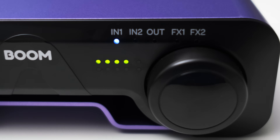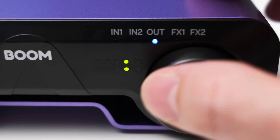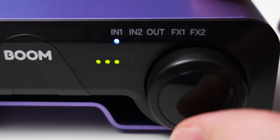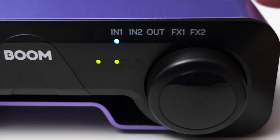On the far right you can find an encoder knob which you can push to cycle between functions and turn to control the main out, headphone volume, or change the input gain. When you plug in headphones, the main output is automatically muted and only your headphones are active — if you want to hear anything from your studio monitors again you have to unplug your headphones. I think it would have been better if there was a toggle in the software for that. The level meter is virtually useless because it's so tiny with only five LEDs, and it doesn't show you where you have your gain set on the input. I really hope they can fix that via a firmware update.